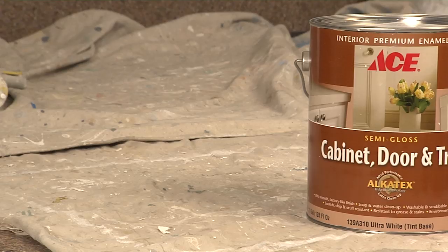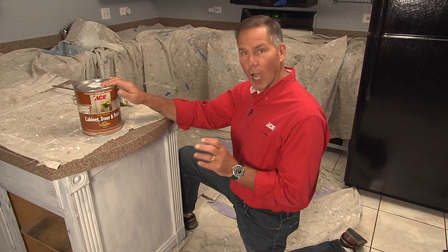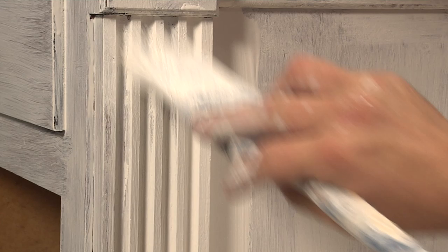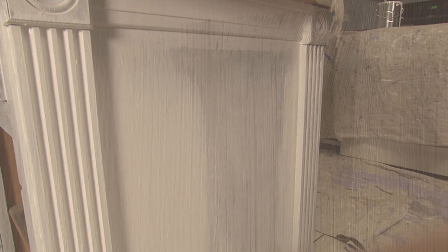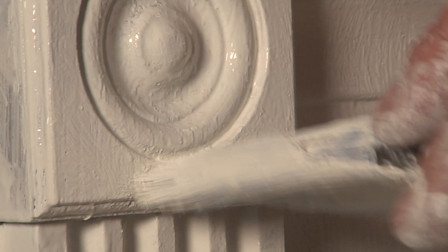The primer is dry and it's time to put the finished coat of paint on. We're using ACE Cabinet Door and Trim Paint — a self-leveling paint — in the color Chalk. On this particular set of cabinets, we're only going to use a brush. Because it's self-leveling, using a combination of roller and brush would cause texture mismatches, so stick with one form of application. When you apply this paint it may look a little streaky at first — that's okay, it's self-leveling. As it dries it creates a smooth skin over the top, and when you put the second coat on, that's when you'll really see how good this paint is.